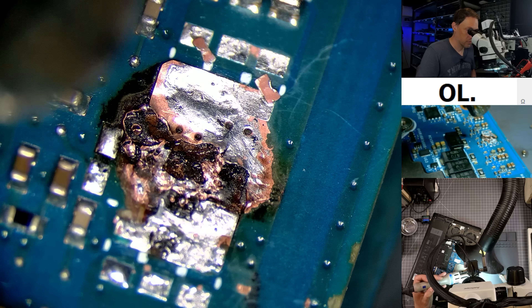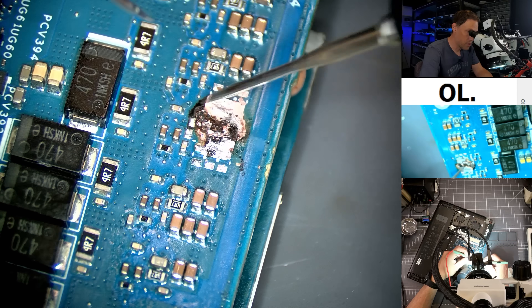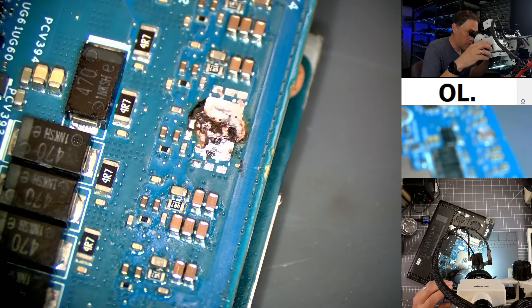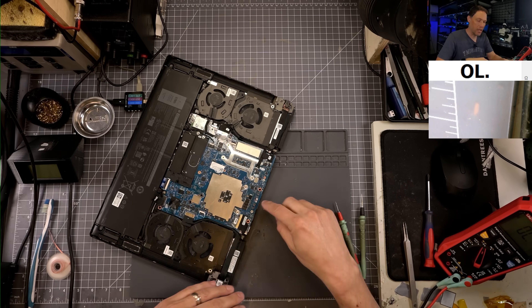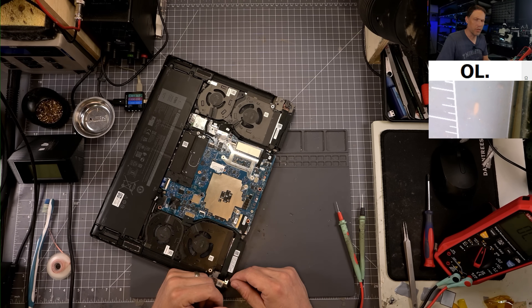We have no components on there yet — we haven't tried to rebuild anything, all we've done is clean it. We're trying to figure out if these board layers are all shorted out together. We can measure across some of these — we're still showing a short, which means it's probably going to be in this area. We plugged in the power and it just turned off the charger again. Even if there's another shorted component somewhere else on the board, that area right there is most likely the culprit. There are many board layers stacked together with a little bit of separator between each layer, and if that got all burned up and they're basically fused together, there's nothing we can do. Even if I tear out that whole section and separate everything and make it where the short is gone, we're not going to be able to rebuild that area. Unfortunately, this is going to be a motherboard replacement — there's nothing really I can do. I'll call the customer and let them know. Thanks for watching — I couldn't save this laptop.